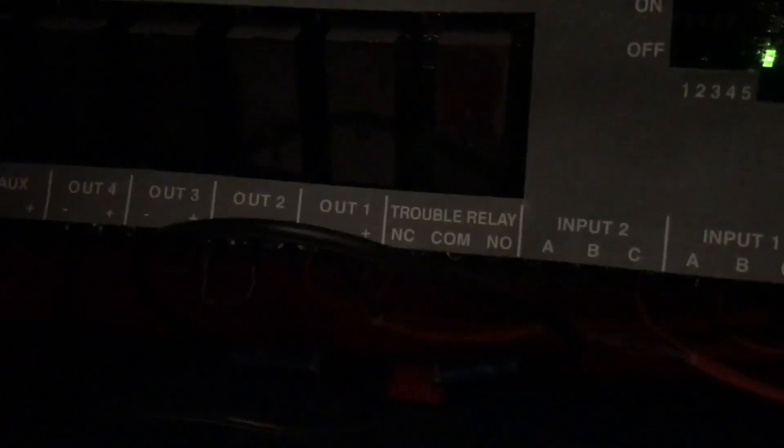The purpose of this booster panel is to provide more NACs to the system and also provide DC current. We will have filtered DC power to my fire alarm control panel. Therefore, I can use any alarm that cannot handle FWR. For example, Simplex — so we can have Simplex stuff on my panel.